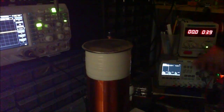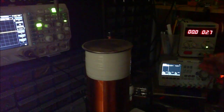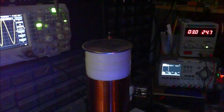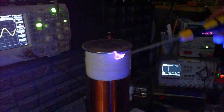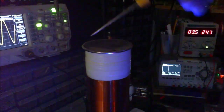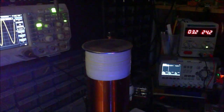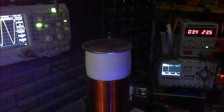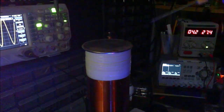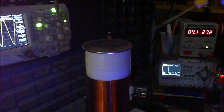Okay, now I'm going to see what it's like without a capacitor. So I'm just going to undo these, so there's absolutely no capacitor connected. Temperature, yeah, still wouldn't drink it if it was a cup of tea, too cold, throw it away. Circuits on, no capacitor this time, 25 volt, let's switch more, there we do, 24.5. I'm not that impressed with the performance of the capacitors, that's if they actually perform at all. Drawing 3.3 amps at 25. Oh, turn it up a little tiny bit, so I've got 4. That's pretty good, and that's with no capacitor.